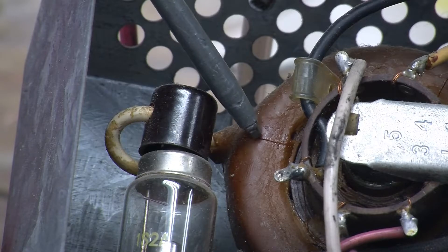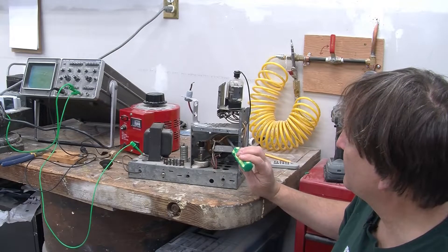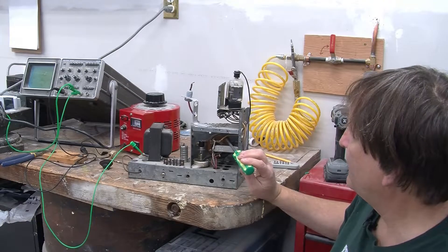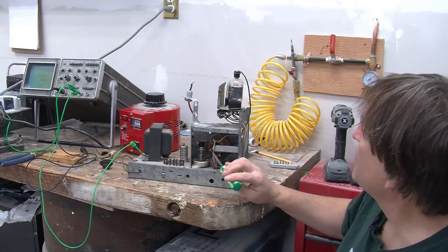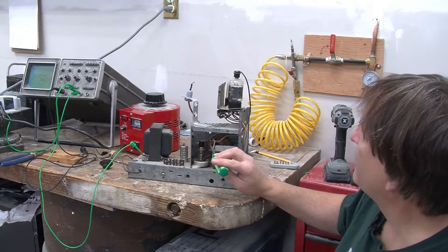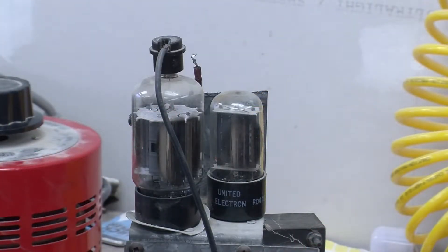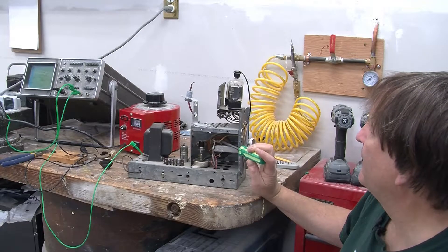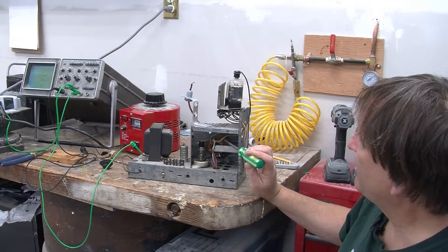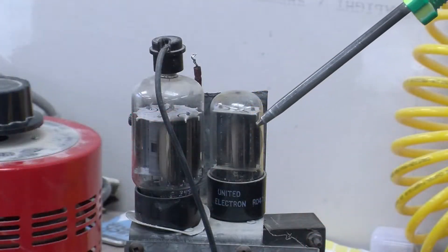To get 18 kilovolts, we have 18,000 loops in the high voltage winding. The outer part of the winding is covered in some sort of goop to prevent corona discharge from destroying the outer parts of the coil. Unfortunately, the goop tends to crack over time and these transformers fail — luckily this one is still working nicely. One of the other windings is attached to the high voltage driver tube, which essentially switches current on and off through the coil to produce a high voltage spike of a couple of thousand volts, then up-converted to twenty thousand volts.